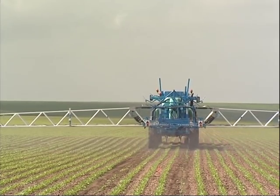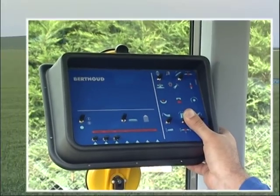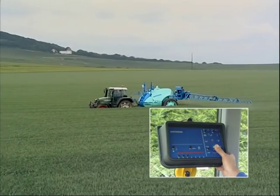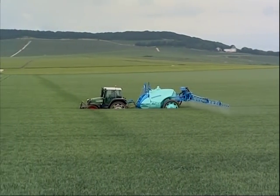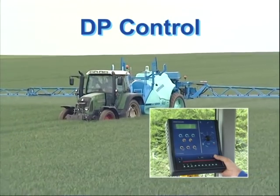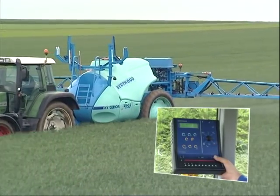Tenor can be fitted with auto-regular, DP-control or DP-tronic regulation controls. The auto-regular regulation allows constant volume per hectare for one gear ratio. Very accurate for speed variations up to 20%, it is simple and economical. As an option, auto-regular can be fitted with a DP-control box. Its second generation monitor provides simultaneous display of spraying settings and is also used to store cumulative data.